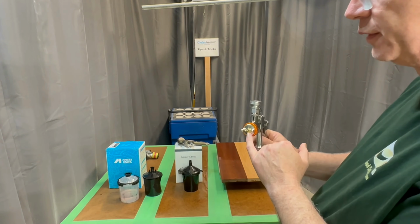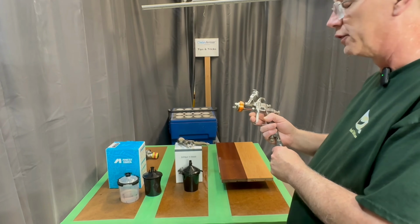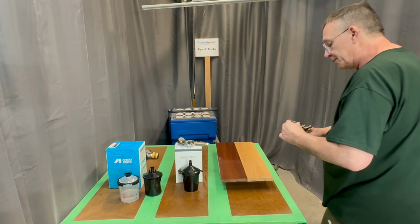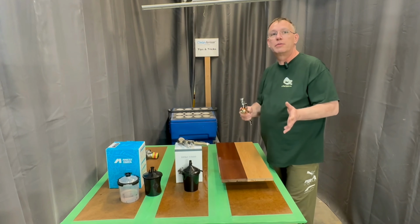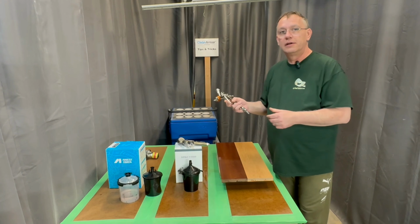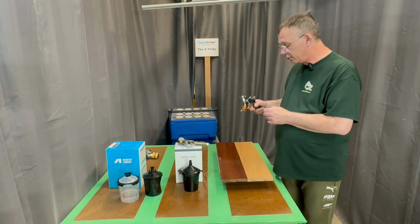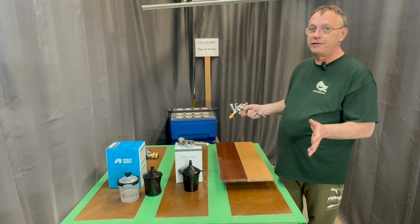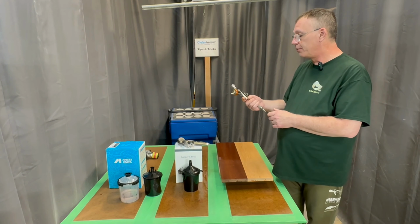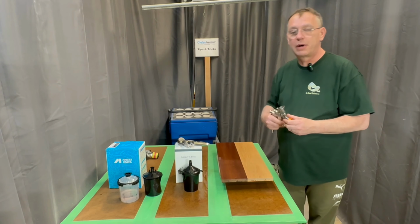As I said, we have a 1.3 millimeter nozzle here, and the air pressure that we typically use is also very low. I remember spraying my typical polyurethane lacquers usually with an air pressure of about 30 psi, and here we're going like 15, 16, so very low, just to eliminate air bubble enclosures and so on, and we have to spray very thin anyways. I'll get to that in a moment, how to set up the gun to begin with. And as I said, I will do some preparation now.